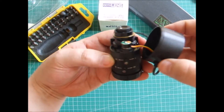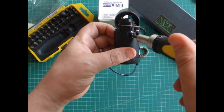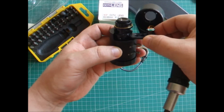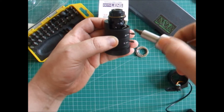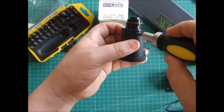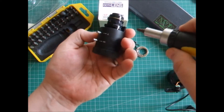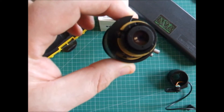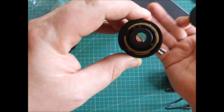All we want to do is remove that, so we just unscrew one of the screws on the side — out it comes. You may need to unscrew the other one on the other side as well, all depends. Just gently pinch that back down and in. Now if we take that off, you can see we now see light through, so the auto iris is now removed.